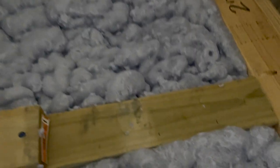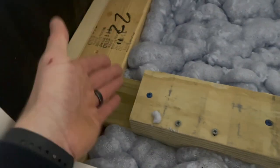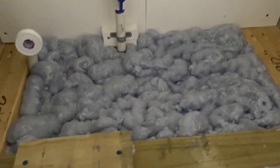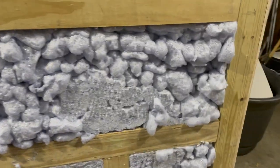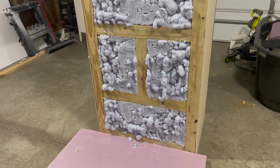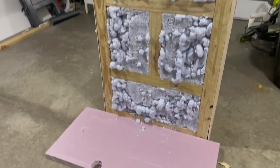Take a peek in the mechanical area — same story there. There are a few pockets of air where I just built up layers of insulation without filling completely. If you do this right and don't waste the first can like I did, six cans should get you exactly where you need to be, especially if you use scrap pieces the way I did.